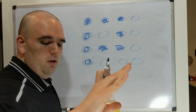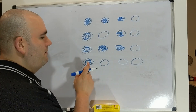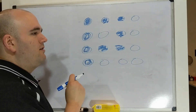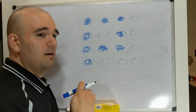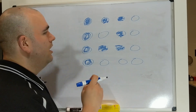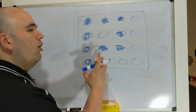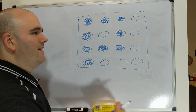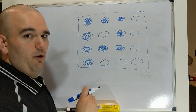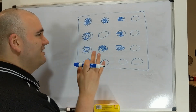A giant display board has a refresh rate cycling through its pixels. It's like 24 times a second — 24 hertz. It's essentially little panels like this that are a lot more dense, all fitted together, individually driven but all controlled by a central system. This is the basic concept driving most displays that you're working with — though there's plenty of other driver technology out there. This is the core concept.